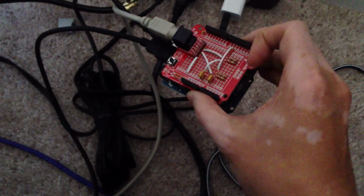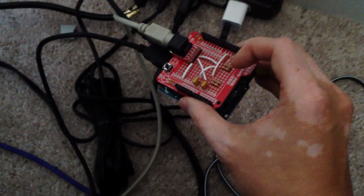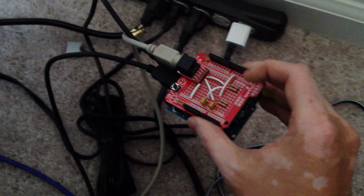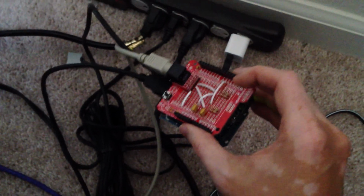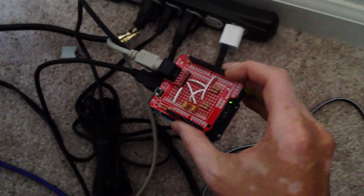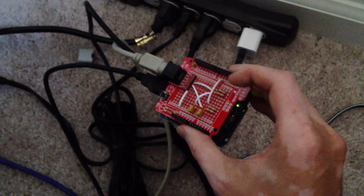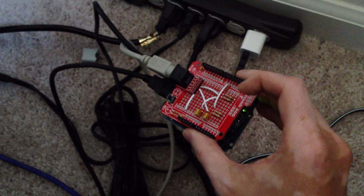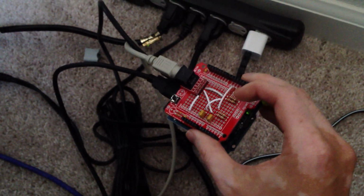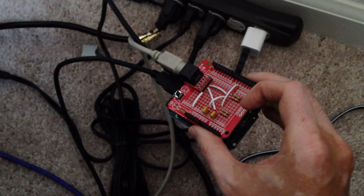So there are some details in terms of what you select for the resistor and capacitor values. You're basically trading off the settling time of how quickly it arrives at that voltage so that the shifting is responsive, versus other considerations like how much the signal ripples. But I just selected basically the values 4.7K for the resistors. This totals to about 4.7K here, and then the capacitor being 1 microfarad.